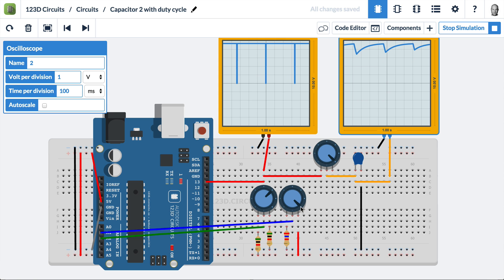Now we're at 99% duty cycle. This is a great way to filter a waveform coming from something that's oscillating — instead of just taking an average voltage, if you put a capacitor across the input with the other side to ground, you can do some really interesting filtering. There you have the basics of filtering with a resistor and a capacitor. You can find the URLs for this circuit and the previous circuit in the description. Go ahead and try it for yourself in 123D Circuits.